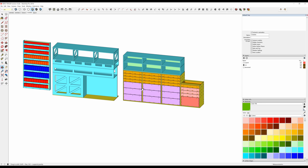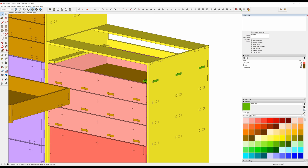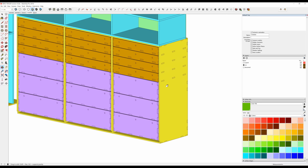Referencing back to the modules, you'll see that each one of these drawers has a runner, and the drawer rides on that runner. The runner itself is mortise-and-tenon into the side. Drop a second color on there and you can see how that works — mortise-and-tenon joints from these runners into the sides, all the way down. Every one of these cabinets is just like that. These taller cabinets are the same as well, minus the bottom sections. Those drawers were so large that we decided to go with full extension drawer slides for those. So there are lots and lots of mortise-and-tenon joints.